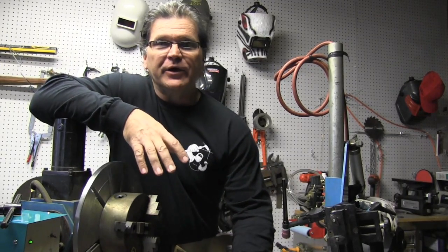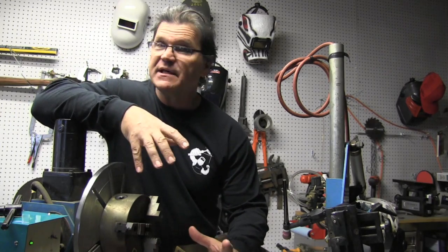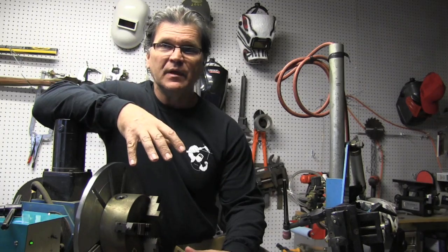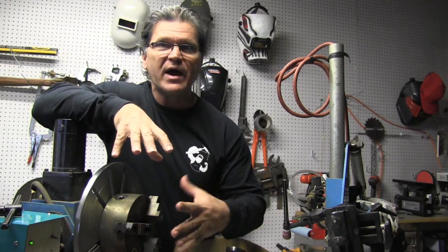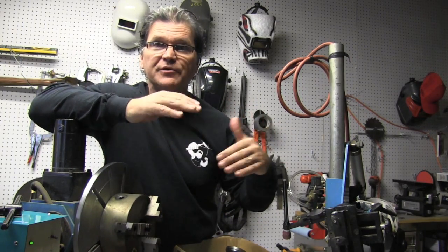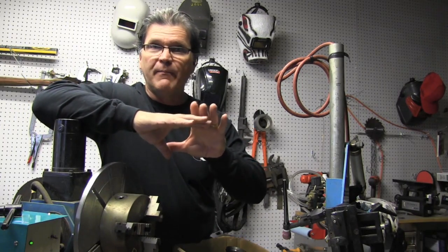Let's take a quick break here and talk about pulse settings. And before we get into pulse settings, let me say this about pulse TIG. Most of the benefits, and there are some benefits, are realized in a completely automated application, where a torch is stationary, with an automated wire feeder and turntable so that you can lock travel speed in. Everything is locked in place, and then you start tweaking with pulse parameters, and you notice a big difference in bead profile or how much it laps over.